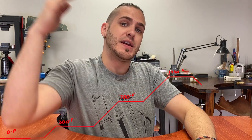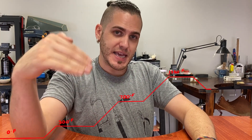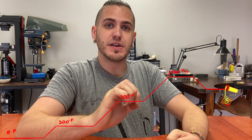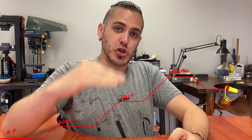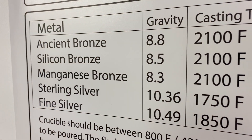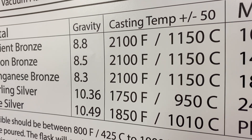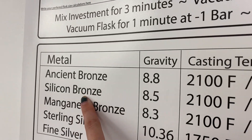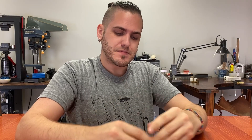Then the last step, stage four, is the ramp down. In many cases, you don't want to be casting your metal into the flask at such a high temperature. The general rule is 1,000 degrees Fahrenheit below the melting temperature of the metal you're casting. For example, with this project we used silicon bronze. Bronze, as a general rule — though this doesn't apply to every single kind — is that you pour bronze at around 2,100 degrees Fahrenheit. So if you use that logic, you lower it by 1,000, it's about 1,000 degrees Fahrenheit. It could be about 1,100, but it depends on the type of model especially that you're casting.